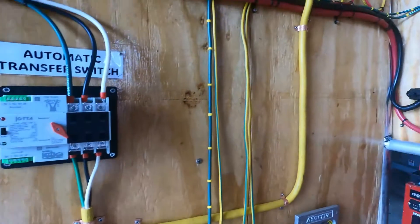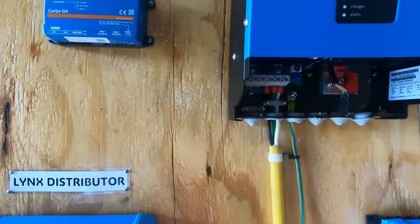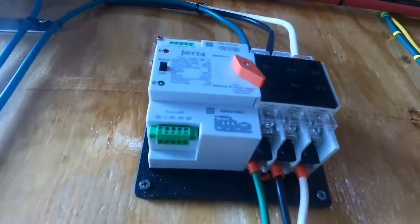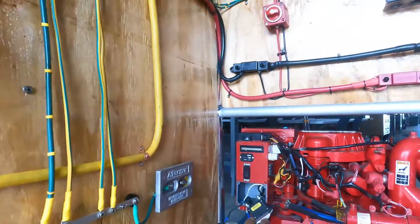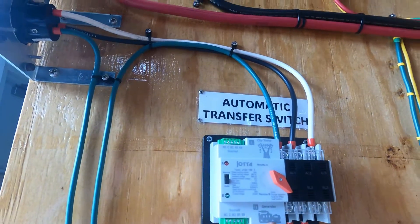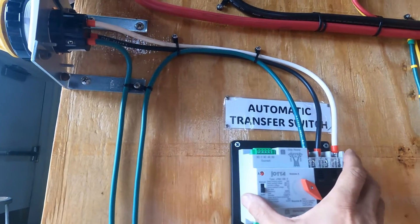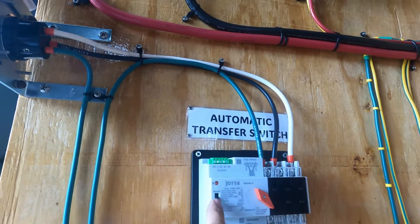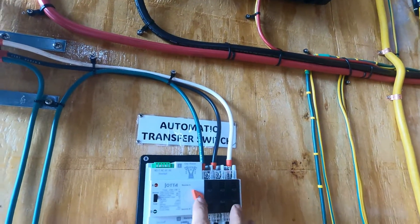This is the command output entering into the inverter charger. As you can see, this is the output in this position — here we will be connecting the breaker, with power coming from the breaker of the generator directly here. We have the generator here, shore power here, and the automatic transfer switch will work in manual or automatic position. In this project it will be working in manual because we don't have contactors — I'll explain what that means later.